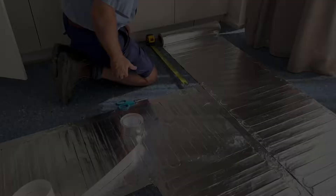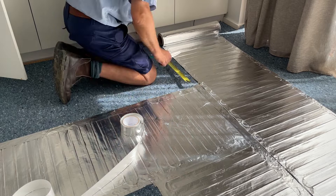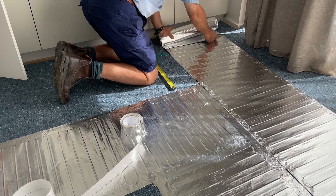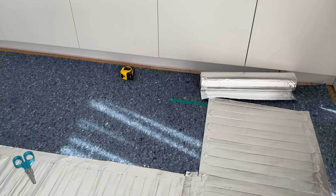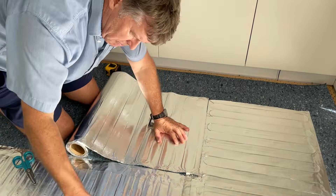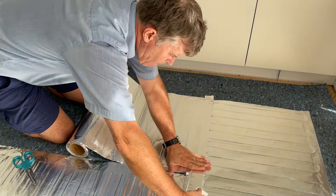Here we are on the last run, doing another 90-degree turn. We measure out the 50 centimeters to make sure we cut in the right place so that when you flip it over it'll meet up with that initial mat that was laid. There we go — flip it over, get some tape, tape it down, and then roll that last length of mat out.